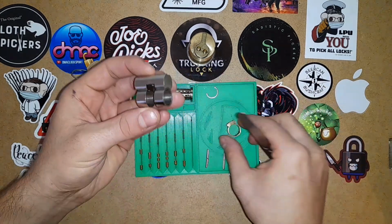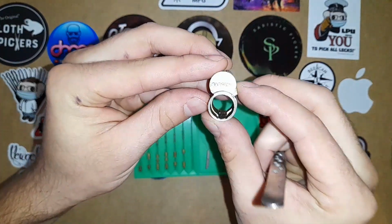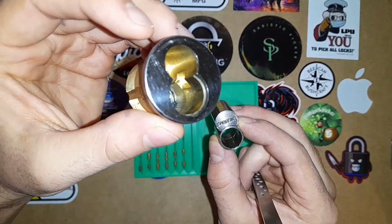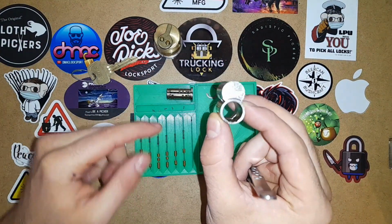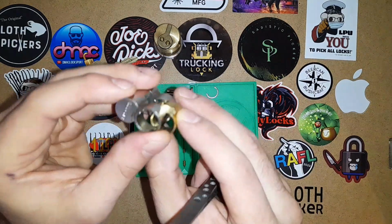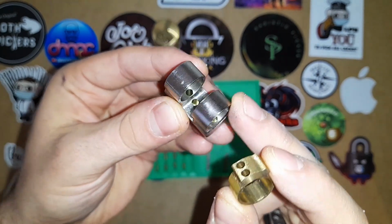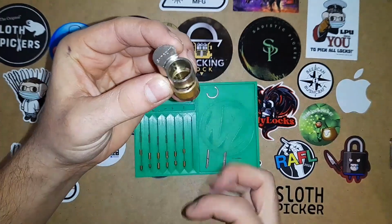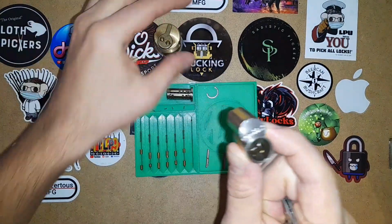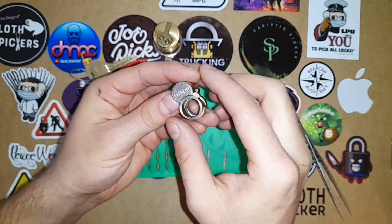This is how the lock would be, in neutral position. As you can see, this one thing protrudes outside, and this is what locks it here, as I showed you earlier. When you use the control key, you lift those wafers inside. They're not wafers, but you lift them and they go inside of this, and as you can see, there are holes in here, and on top of course we have our standard pin chambers. When you lift them, you can pull them to this side, and this will unlock the core, and you can pull it out, swap it with another, or put it somewhere else, then relock it with the control key, and you have just swapped the lock, which is pretty cool.